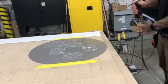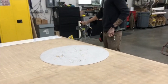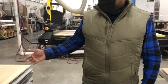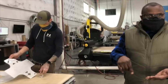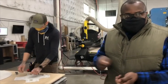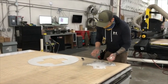Mike, that looks pretty good. Is that ready to take off? So we put masking on the back of the plate that we're going to use, just so all those little parts don't come out and fly while the machine is running. The vacuum helps with cleanup because you want the cut all the way through. There's less deburring to do — we're still going to need to ease the edges, but this helps with less of that mess. I'm very familiar with deburring — it's one of the jobs they let me do when I'm on the shop floor.